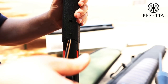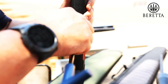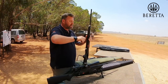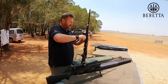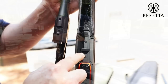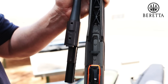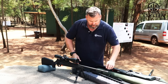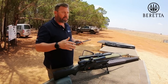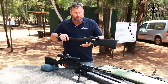The firearm comes with its own Allen key, which is there to take your firearm apart. Put it in, unscrew the bolt — the bolts actually stay in the stock so there's no chance they'll fall out — and you just loosen them and your barrel comes off. You'll notice that your barrel fits into an aluminium V-block, so it's a nice, secure, rigid system to mount it in. These barrels are also going to be interchangeable going forward, so your firearm can be a modular system and you can change calibers at a later stage.